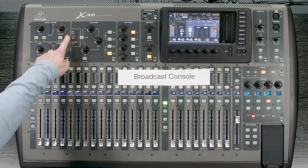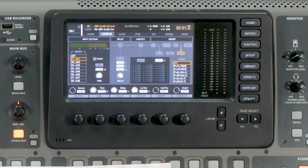One thing to note about this setup: the gain on your channels on the broadcast console is actually a digital trim. So if you clip at front of house on the preamps, your channels on the broadcast console are also going to clip — even if you turn the trim down to negative 18, the channel will sound as if it's distorting. Keep in mind that you need proper gain staging on your front of house console for it to be properly gained on the broadcast console as well. You can see this by pressing View in the Configuration and Preamp section, where you have your trim ranging from positive 18 to negative 18. Thanks so much for watching — I hope this helps you and Chuck. Drop any other questions in the comments section.